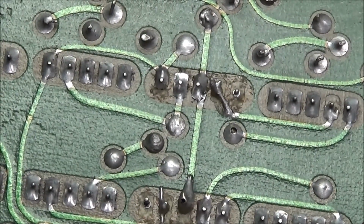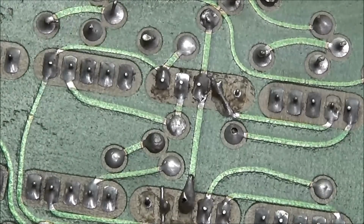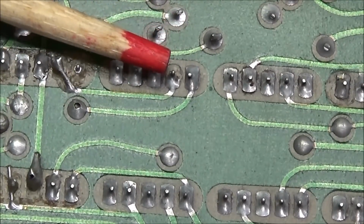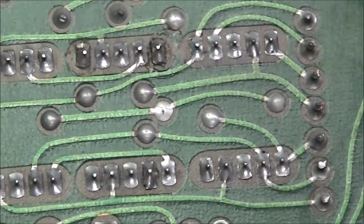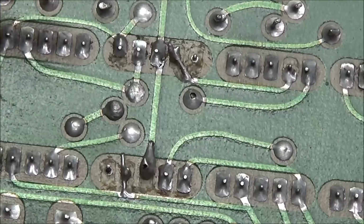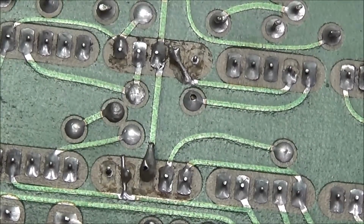and what we need to tackle now is this center display segment, and see if we can repair those traces. No problems with the rest of them. Did lose half the trace on this one here, but there's no problem at all with that. The rest of it looks quite nice. So probably the best thing to do with this one is we'll go ahead and desolder this segment and get it out. I've already cleaned the board, but after we desolder it, we need to clean it again.